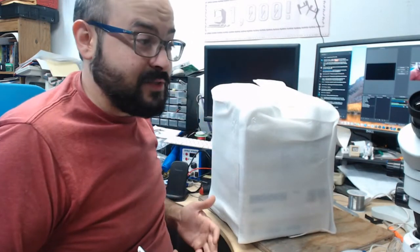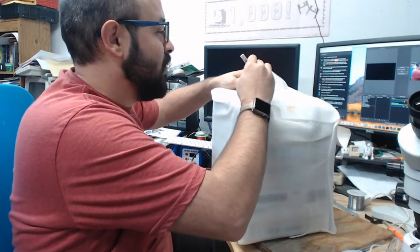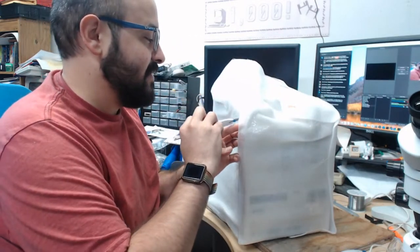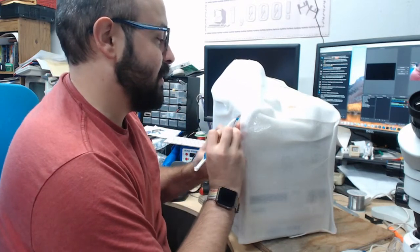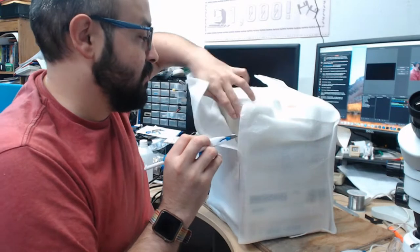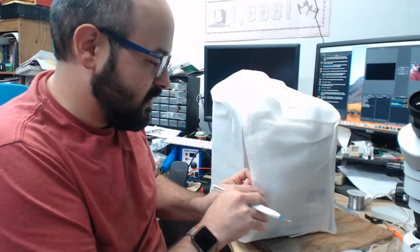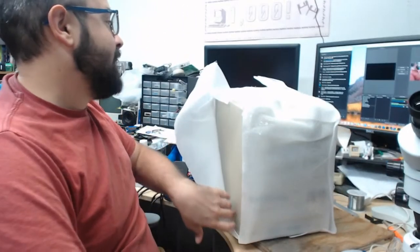Well, the programmer and interrupt switches are for programming and interrupting programs and debugging systems. If you look in one of the very old manuals, like for the Macintosh SE or for the Macintosh Plus, etc., it'll tell you what those switches do, and they are really designed for exactly what it sounds like. For when you are programming a Mac and something freezes, you could debug it. You could probably enter, what is it, MacsBug or whatever, debugger or whatever that is. That's really what it's for. And, you know, one of the switches will restart the machine if it's frozen up, so... I mean, that's the other use for it. MacsBug. That's...